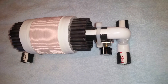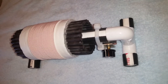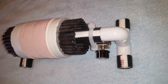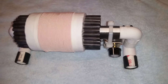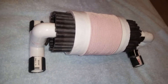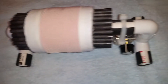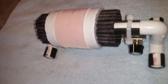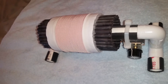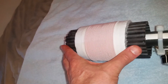Hi, it's Gary DeBock of Puyallup, Washington, USA, and this is a brief video demonstration of the new 3.5-inch Baby FSL antenna. This is another of the airport-friendly models that was designed to routinely get through TSA security checkpoints at major airports. To accomplish this, it has a low-profile, relatively small diameter — 3.5 inches — using 27 of the Russian surplus 160-millimeter by 8-millimeter ferrite rods.